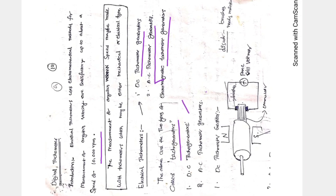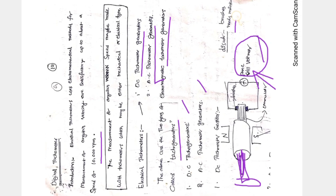How does a DC tachogenerator work? It is similar to a DC generator. The probe is connected to the rotating part, after which some voltage will be generated. The PMMC voltmeter measures the unknown voltage. DC tachogenerators: when you connect the probe to a rotating object, a DC voltage is generated according to the speed. The voltmeter shows the speed — the faster the speed, the more voltage generated. That speed is measured using the DC tachogenerator.